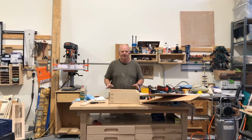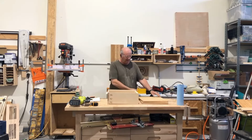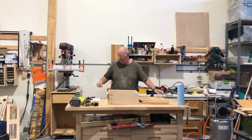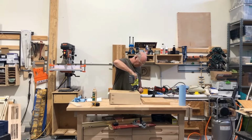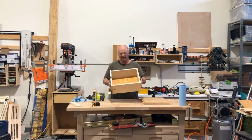These are shop drawers, so I'm not too concerned about what they look like. So I'll get those all cut. So now I have all the panels cut out. Now it's just time to install them all. I'll just put some glue around and then some brad nails. Here's drawer 1 complete. I'll just finish all the rest of them, sand, and then apply 3 coats of poly.